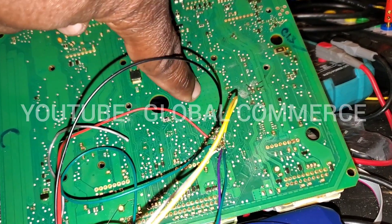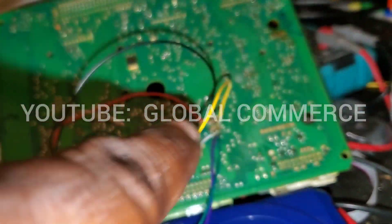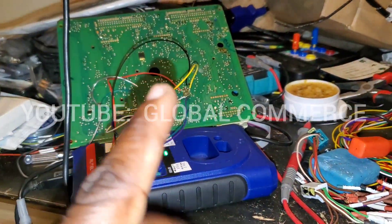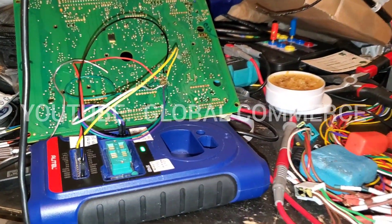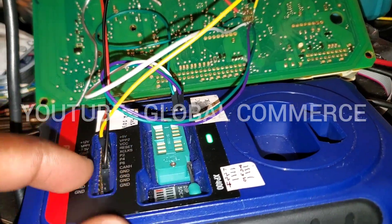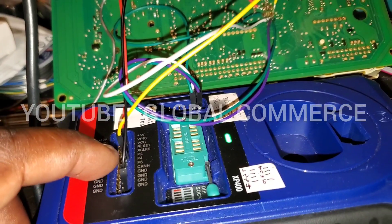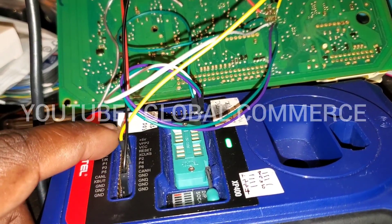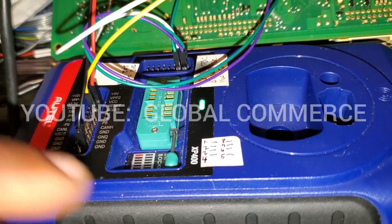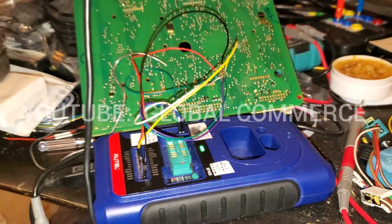This is the MCU — the chip, the microprocessor — and I'm soldered onto the points where I have access to the processor. You got to stay to the end; I got information on the schematics and everything like that. You're going to need to connect up with these type of cables so that you can grab the different points that you need. It's approximately seven cables you're going to need. You're going to get your power at VPP, reset, ground, and a couple of I/O pins. I'm going to show that to you later.